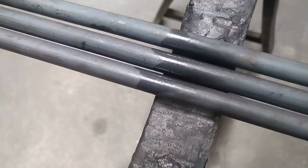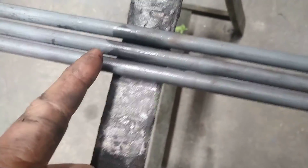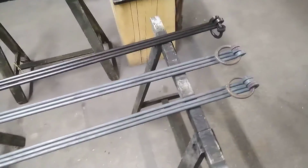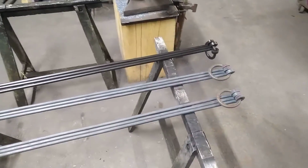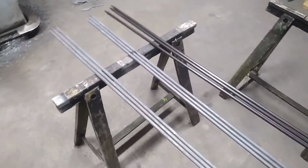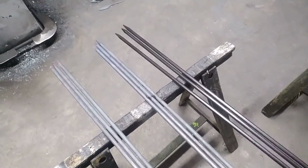That's what you want to look out for, this moisture line, and you follow that up. Where's my finger gone? There. You follow that up until the whole thing's then dry. Then when you put either beeswax or oil or whatever you're finishing it with, you put that on, and it then seals it, so it seals it with no moisture inside, which means that you don't end up with things that rust after a little bit of a longer time. So that's why you heat stuff up first.